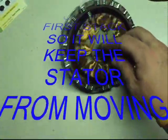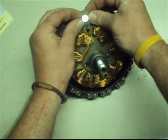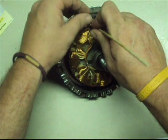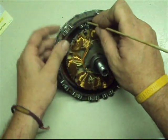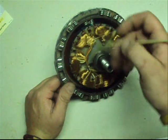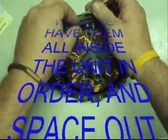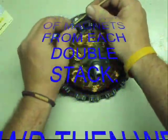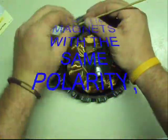I'll get the extra magnet out when I'm done. Okay, so now we just want to start knocking these things over — you can do it like this, or you can put your stick over here and slide this down and it'll stay with this one. I know this is still north, south, north, south going in a full circle. We'll space them apart later. When we get these things spaced out nice and even, we'll glue down the first set of magnets and then move the other ones over to it and glue them there. Don't work against the magnets — work with the magnets.